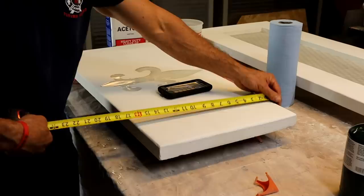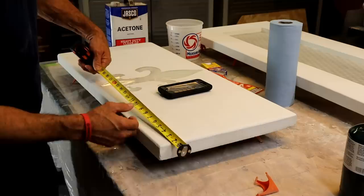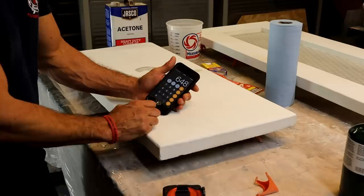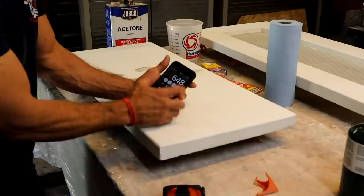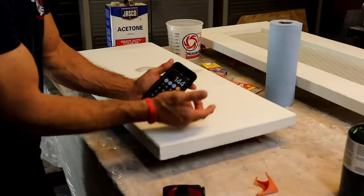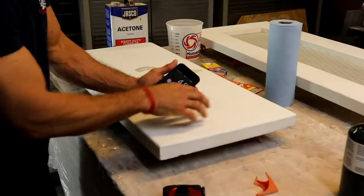Right here we have 16 inches. I'm going to make this 18 inches because we have the edges all the way around to cover as well. This part is 36. So we take our 36 times 18 and we have 648 square inches. We're going to divide it by 144 because 12 inches by 12 inches is one square foot — you divide your inches into square feet. That gives us 4.5 square feet. Then I'll measure my other piece and total it, and we'll mix our stuff.